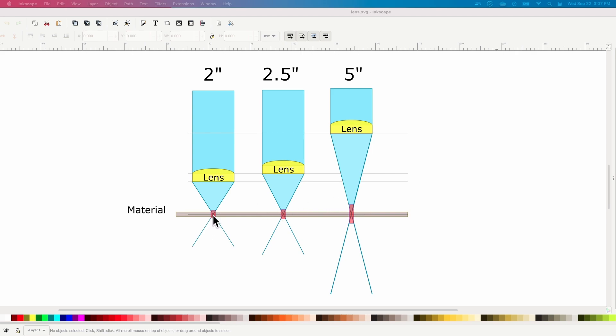With a two inch lens, you get a very sharp, very tight focal point. Whereas on a five inch lens, it's kind of wishy-washy — there's quite a bit of distance before you actually get to the focus, and then quite a bit of distance beyond where the laser is still usable. If you had a piece of material about three millimeters thick — a typical piece of Baltic birch plywood — with the two inch lens it's very tight but very focused on the center of the material. The energy density at the focal point is much higher because there's less energy lost above and below the material.